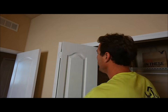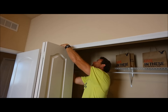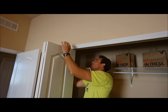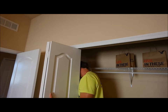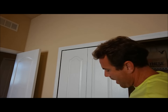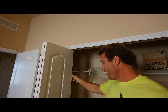And again, go through the procedures to adjust it. Now in this case, it's too close to the wall. Slide it out a little bit. Tighten that set screw. The bottom's a little close. Move the bottom back out. There you go. Look at the gap. And again, do that back and forth so you get the reveal of the door and in between the doors the same all the way around.